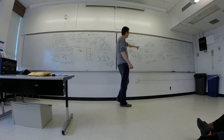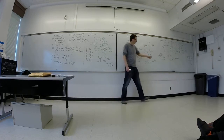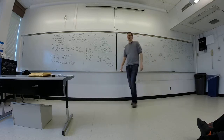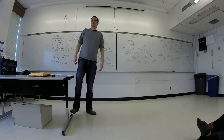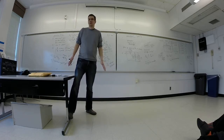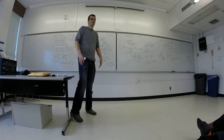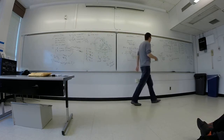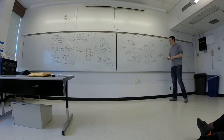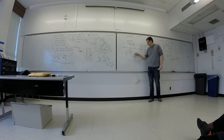When it's in ammeter mode, it's a very small resistance because it assumes you're going to put it in correctly. And when it's in voltmeter mode, it's a very high resistance, because it assumes, again, that you're plugging it in correctly. So if nothing else, to save the lab instructor a headache, make sure that you're plugging them in correctly. So common mistakes. Common mistake is to put in a voltmeter in series. Something like that, okay?